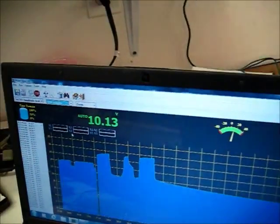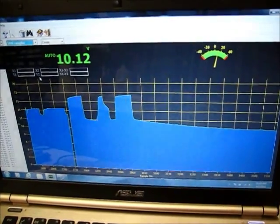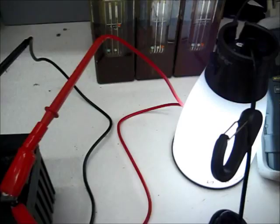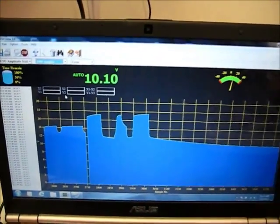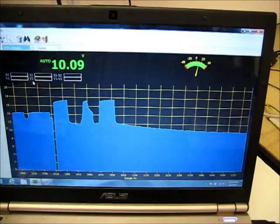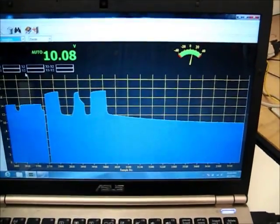We've been on for a while now and we're still continuing to maintain about 1.6 volts per cell. We're not going down very fast. I'm looking for the 1.2 volt range. We're just pulling the charge off the top of this now until the cell can plateau. I'll continue doing this and then come back — because I don't want any mistakes on this at all.